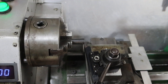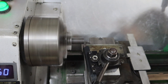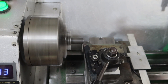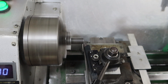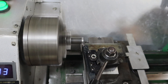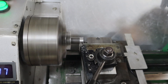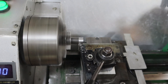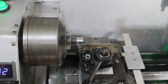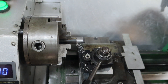Alright, so I've already set it up in the tool holder and got it centered by facing it off. Let's see how we go turning with it. I also adjusted the spindle bearings - I mentioned in the last video they looked like they needed adjusting again, so I've adjusted them up. Let's make a 0.25mm cut just to try it out, and then have a go cutting backwards as well.